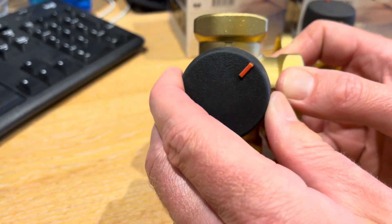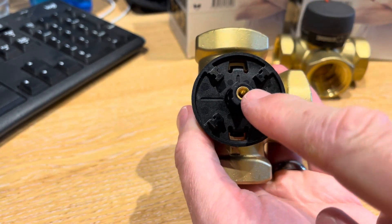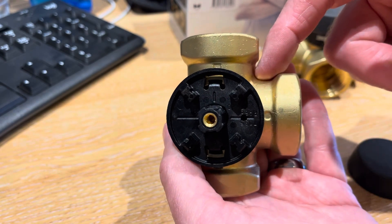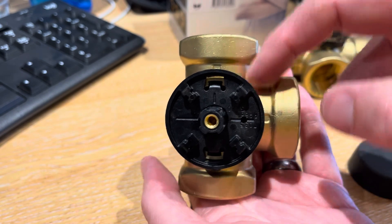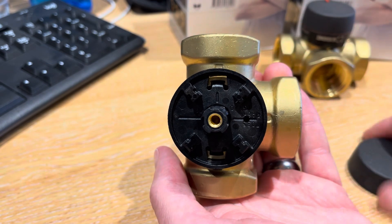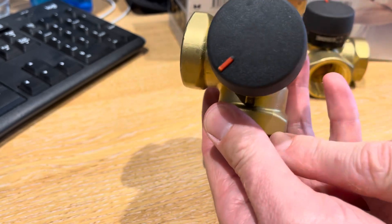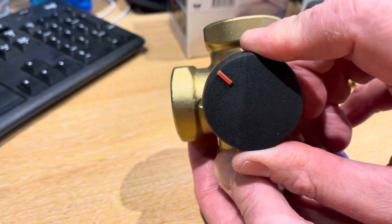So that is the 131. Always important, depending on which way you've piped it — if you have it round that way, you need your lug, which is part of your castle. The castle has one lug here, one lug there, and a missing lug. The missing lug must be in the centre of the two ports that you are trying to go out of. Whichever your output ports are, that missing lug needs to be between them. If you have it one way — input, output, output — it's got to be there. If that is your input and those are your outputs, you need to rotate it so it's between those two ports.